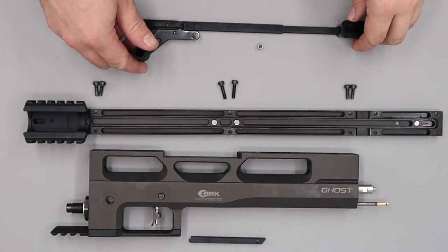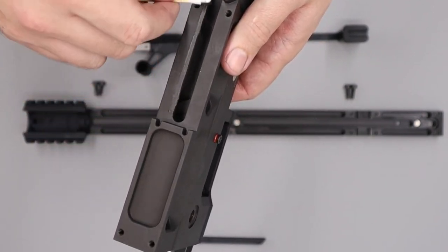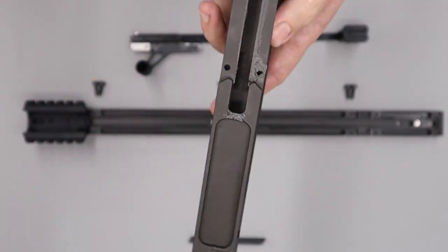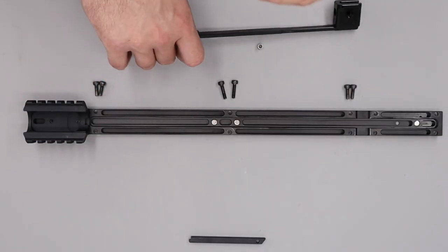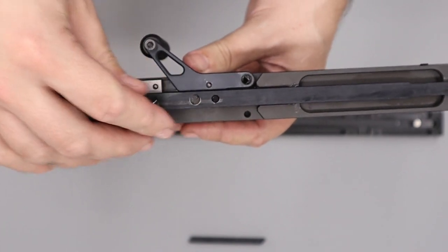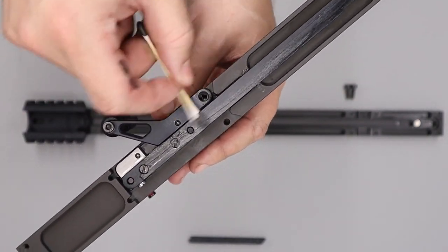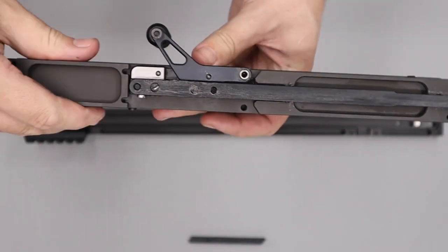Add a small amount of moly grease to all the moving surfaces — first into the groove on the block. You don't need much; this isn't a high-wear application, it just makes the bolt feel nicer as you pull it backwards and forwards. With that done, add the cocking linkage to the block, dropping it into the groove and making sure everything lines up. Add a little more moly grease to the hole and the top rail, then take the bush, install it into the hole, and get the top rail installed over it.